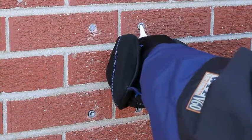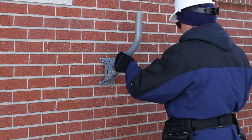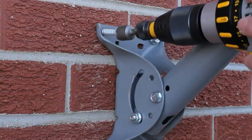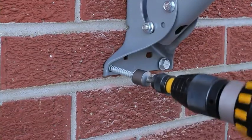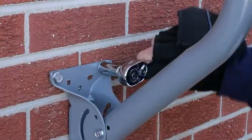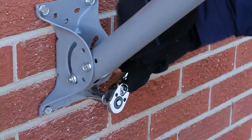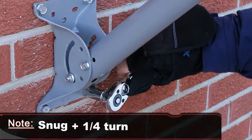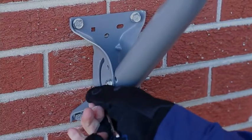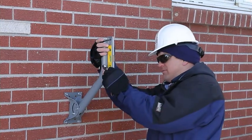Fill each of the pre-drilled holes with silicone sealant, then align the footplate over the pre-drilled holes. Once the footplate is aligned, drive a two-inch lag screw into each of the four corner footplate holes. Only drive the screw in 99% of the way, then tighten down all of the lag screws by hand using the half-inch socket wrench. Remember to tighten them all snug plus one-quarter turn. Verify the mast is level and tighten the hardware on the mast — be sure not to over-tighten. Once the mast is tight and level, place the assembled dish on the mast.